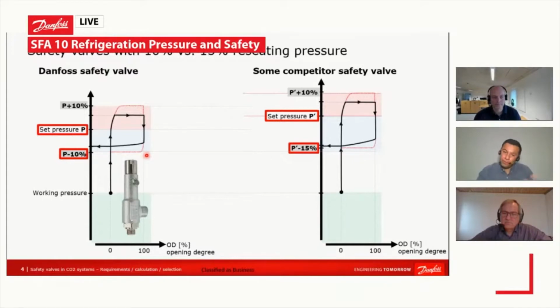On the other hand, soft sealings are usually bubble tight if they are made correctly, but they are sensitive to the type of refrigerant, to the type of oils that you have, and also to aging, temperatures and opening. So we have to take these things into consideration depending on the system we are talking about. In general, with refrigeration and the common refrigerants, we will prefer a valve that is gas tight, so we don't lose refrigerant over time.